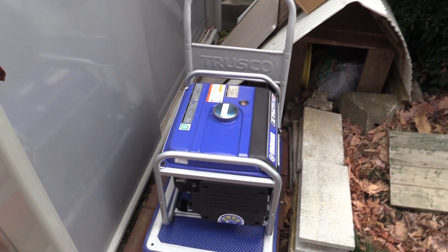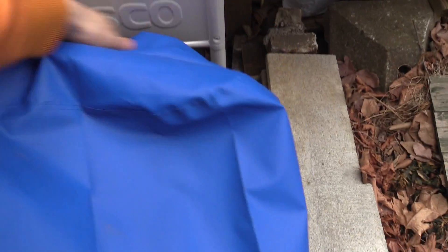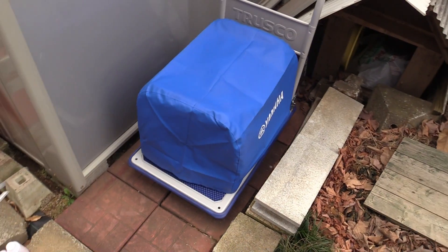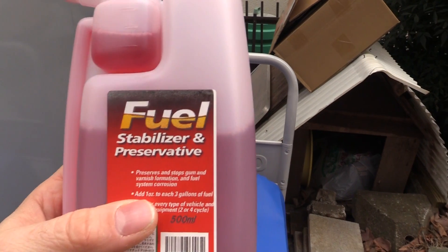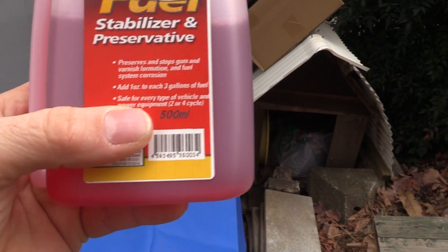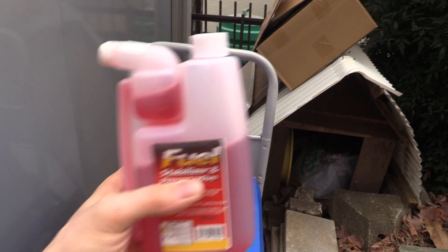So that's pretty much all we need to do before we put this thing away. If your generator manufacturer has the option, I recommend getting a cover - I've got this one here - just to stop things falling on it and keep everything nice and clean. That's ready to go in the shed. Another thing to think about: get some fuel stabiliser preservative. This keeps the fuel for about two years or so. This one says one ounce per three gallons of fuel. Stick it into your jerry can, mix it up, and that will keep the jerry can of fuel nice and fresh so that when you need it in an emergency, it's going to be there ready to go.